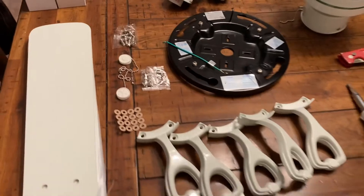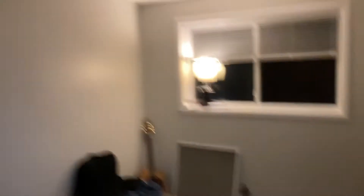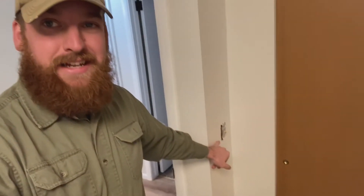These are the little pull chains for the fan and the light, because I'm going to be wiring it in the guest room and using one light switch since there's only one. It's not like a three-way where there are actually two wires going to it, so I can't control the fan and the light separately. So I will wire the fan and the light together on this switch, and then you can control them separately with the pull chains. That's the plan.